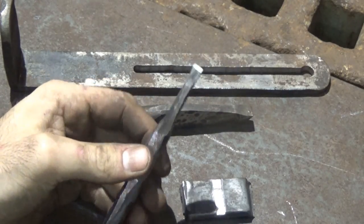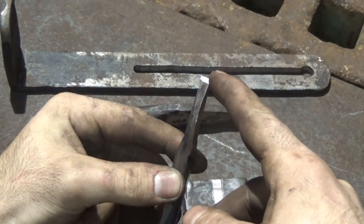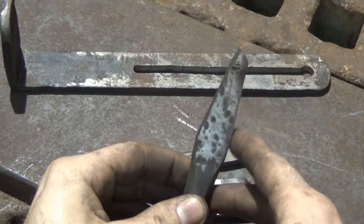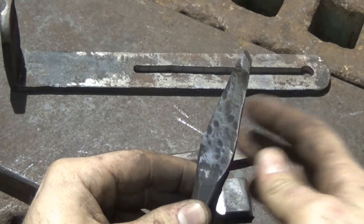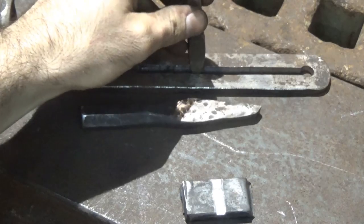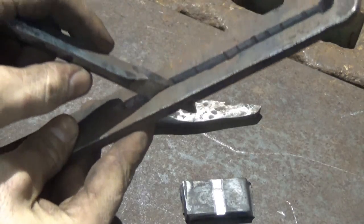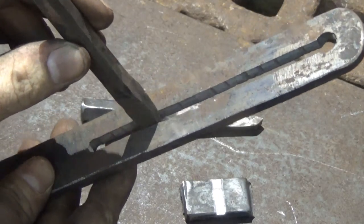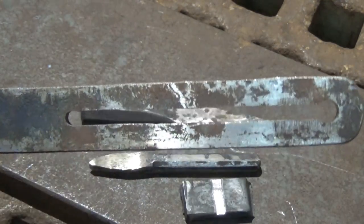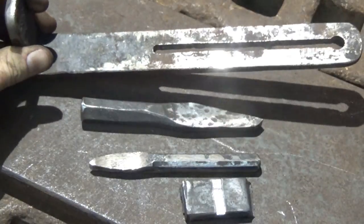Before mills, this was the tool for that. You can see there's a thin spot right here — thinner than the cutting bit — and this is left wide just for support. The reason is that if you're cutting a slot in something, once you cut all the way through, that thin spot allows the chisel to be removed very easily. It doesn't bind up, like a normal cold chisel would the further you get in there. Something thin like this might spread the web apart, and you don't want that.